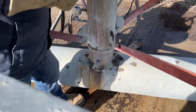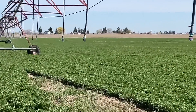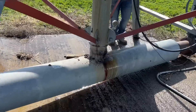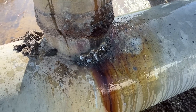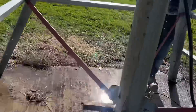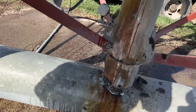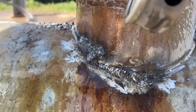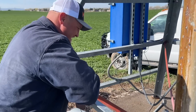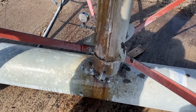Now we just have to put everything away and flush this pivot so it's ready to go. We hit the switch and they're starting to turn on. Let's check our welds and see if they're leaking — no leaks on this side. Even though it looks like chicken scratch it's holding. The little drips you're seeing are coming from up here. There's one little pinhole on this side. On the side Christopher did there's a pinhole on the top left squirting out a little bit. I guess you're not as experienced — just kidding.